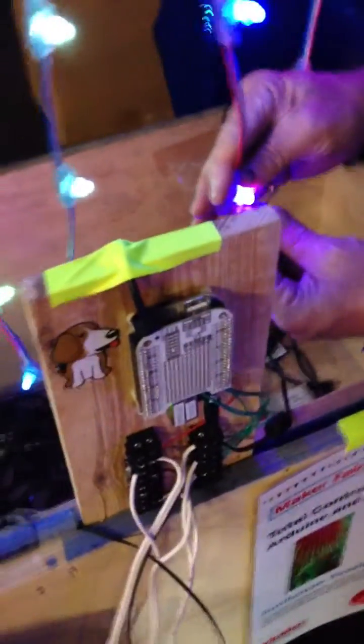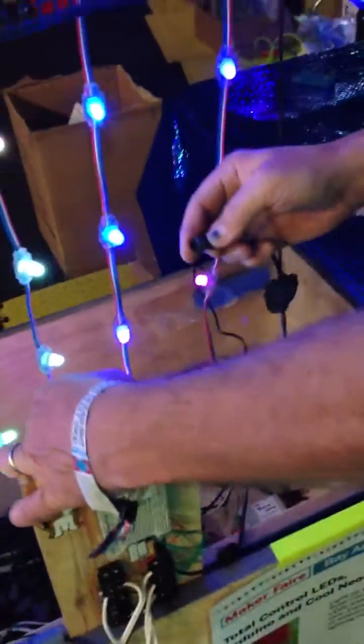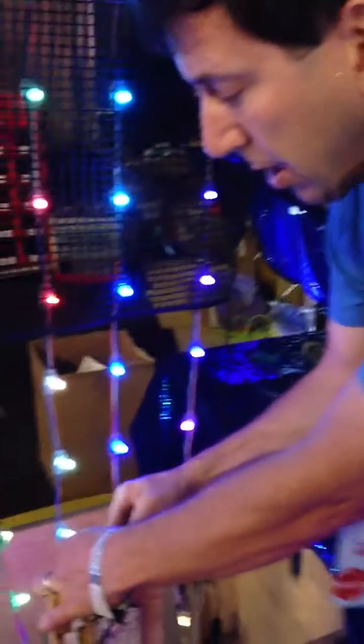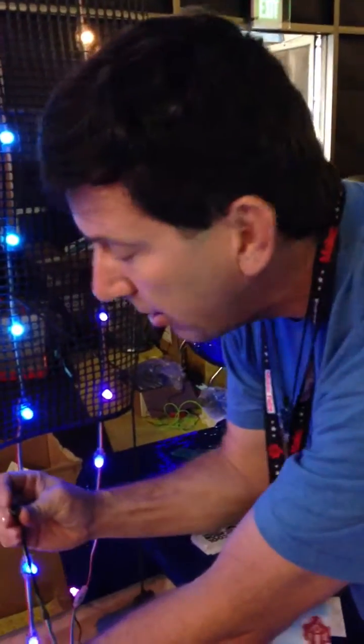Here's the BeagleBone, and what you're doing is moving it from the current BeagleBone that's driving it and hooking up to the other BeagleBone. Yes. And this is all just SPI shift registers. You're dropping SPI from BeagleBone at one megahertz frequency, and that's feeding all the values to all these LEDs — 1,250 LEDs running at over 100 frames per second, all serial.